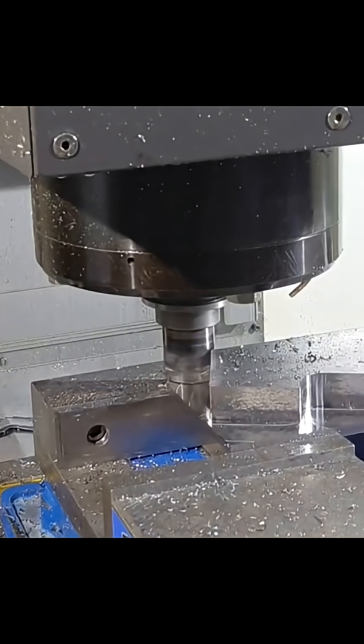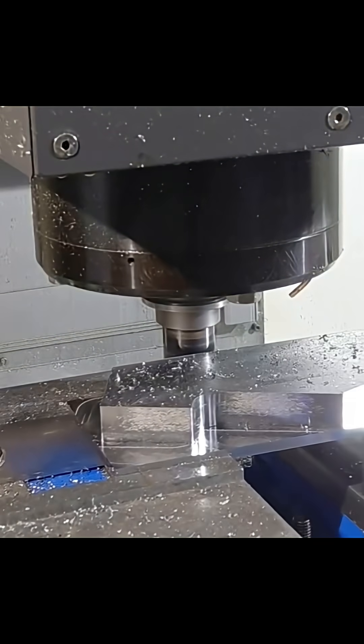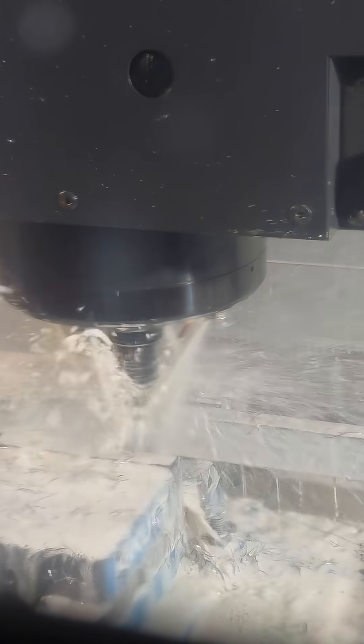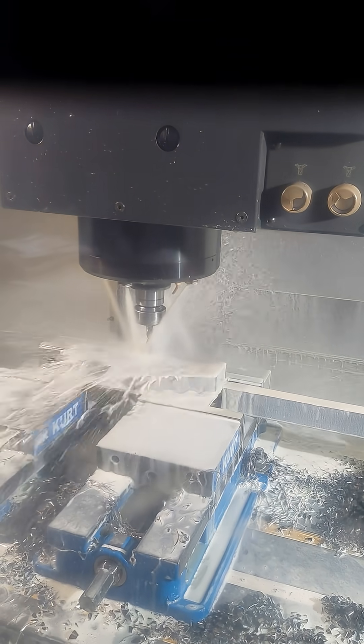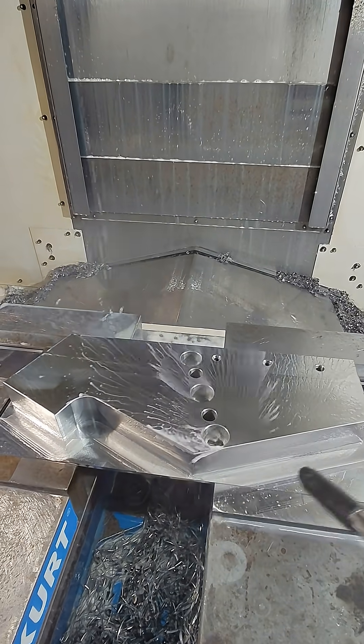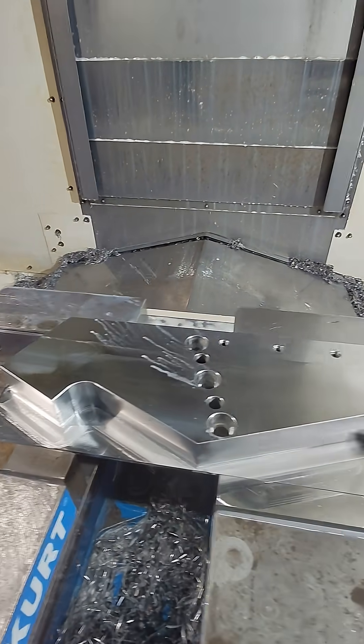These don't leave a great finish, so as I'm sure you would expect, we're going to come in with a five-eighths end mill and finish off the profile. Then after some drilling, tapping, reaming, and deburring — voila, we got a part every 18 minutes, which could be shorter but I'm happy.